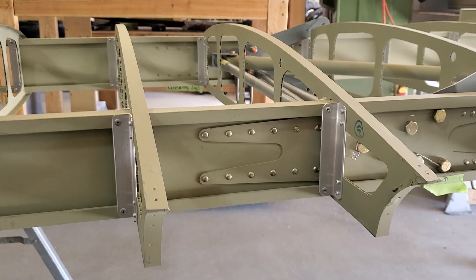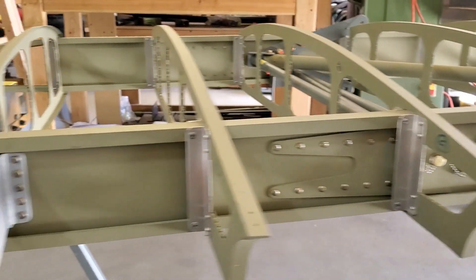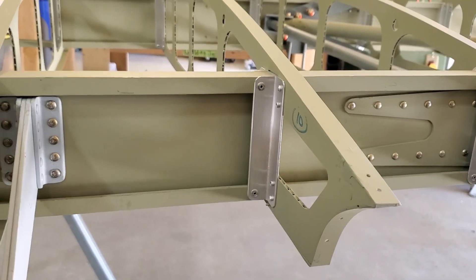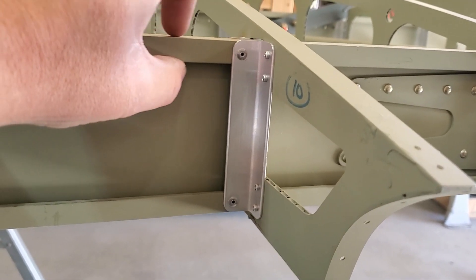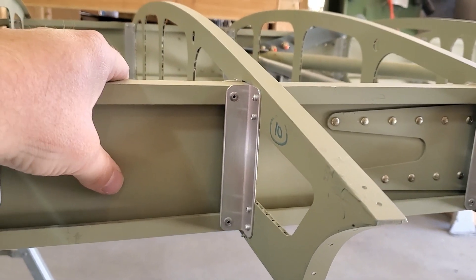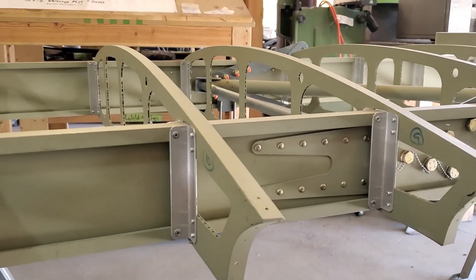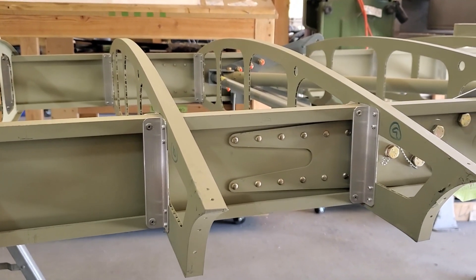Here's a wing that one of our customers is building. These holes were pre-drilled on the CNC, this web was cut out on the CNC, and these rib holes were cut out on the CNC as well. What's nice about that is this rivet needs to be exactly centered on the spar cap, and the router was able to do that. Not only does it do that, but it positions all your ribs for you, so you don't really need to worry about getting something wrong as far as your layout goes on the table. And if you do see something wrong, then that's an indicator of an issue you may not have caught otherwise.